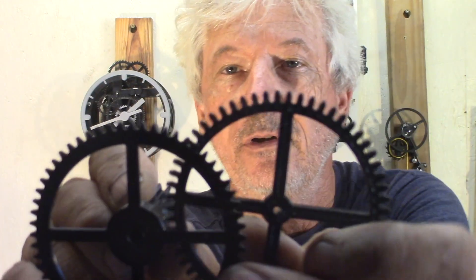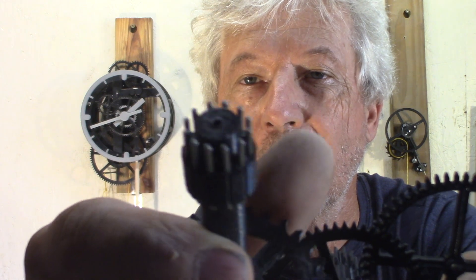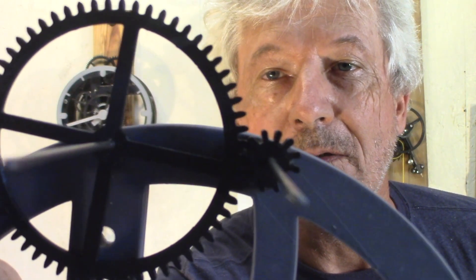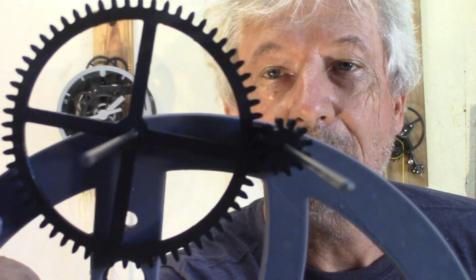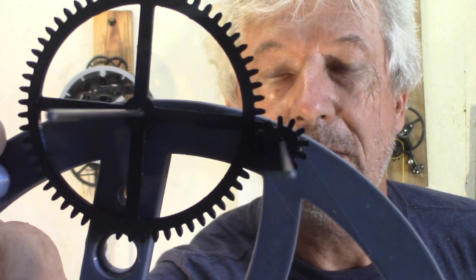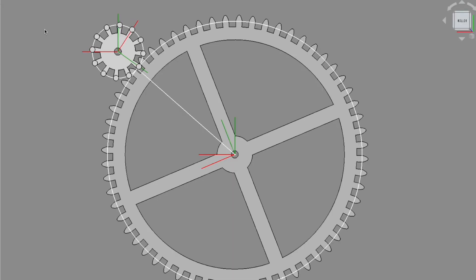I also wanted to test other gears, like a cycloid gear. That's the tooth profile I have now — involute. I want to try cycloid; you can see the difference. With the cycloid, for the pinion I have two options: one is a lantern gear with pins like this, another option is a cycloid pinion. And since it's a pinion that's driven by a big gear, it's a cycloid with rounded ends. You can see it better in this animation in FreeCAD.